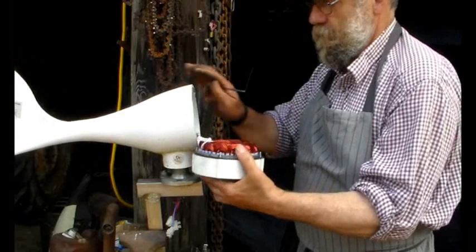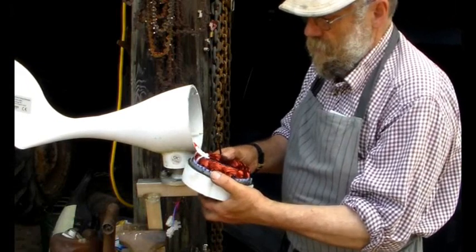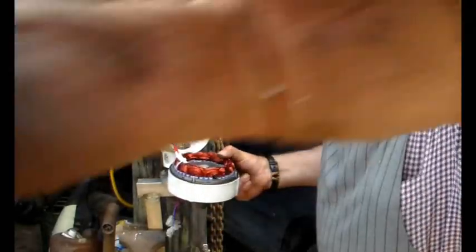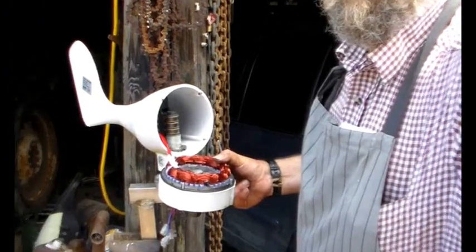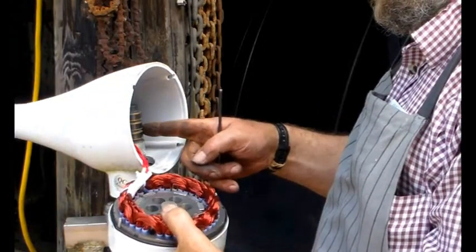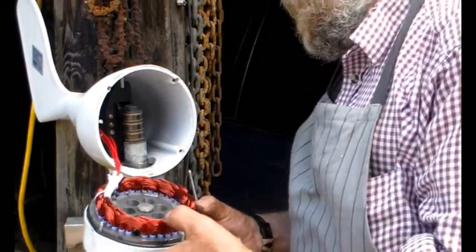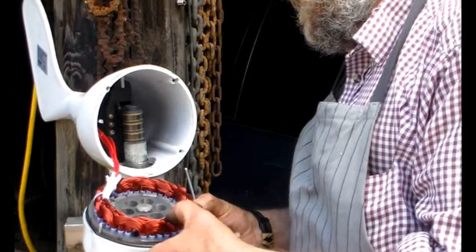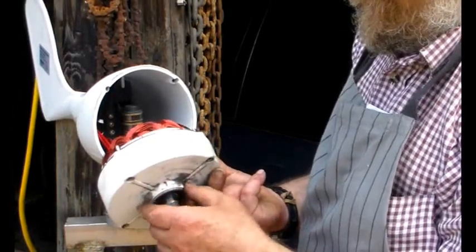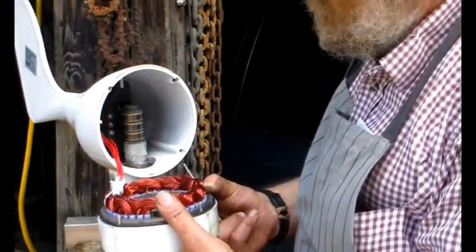Whoa, well that's impressive. We've got three slip rings there - that's the three phases of this alternator. The windings themselves don't look bad, although I'm calling them a bit loose. And there's no back bearing here - both of the bearings are in that hub. So this is overslung as it were, which is a bit rubbish.